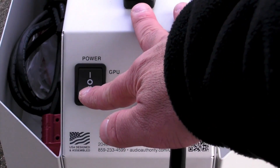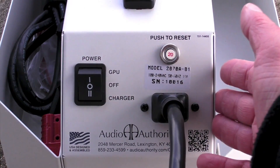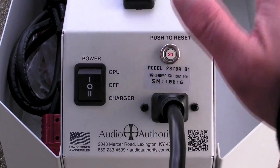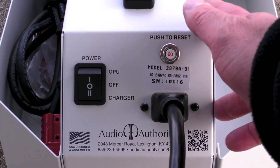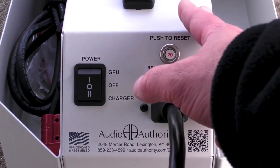The 2870A is more than a ground power unit. It also has an integral battery conditioner housing the Battery Minder, a product made by VDC Electronics. Like so-called battery tenders, the Battery Minder is designed to gently charge the battery as completely as possible and then continuously maintain it. It won't cook it like a traditional battery charger will.